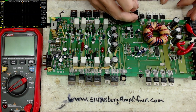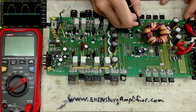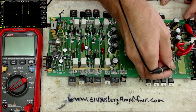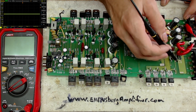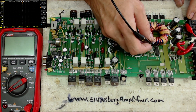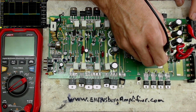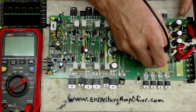Let's trace back why it's creating that shoulder. Here are your gate resistors next to the gates. Q7 and Q8 are the buffer transistors for the drive of the TL494. The drive for the TL494 is coming off of pins 9 and 10, which is pretty standard for power supply circuits. There you have a nice square wave on pin 9 and a nice square wave on pin 10, so you know the TL494 is functioning the way it should.